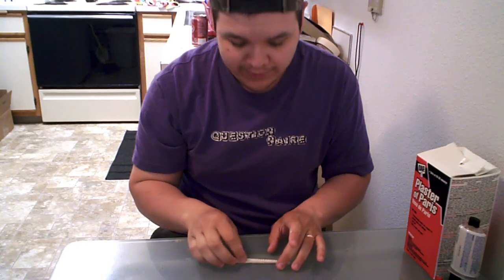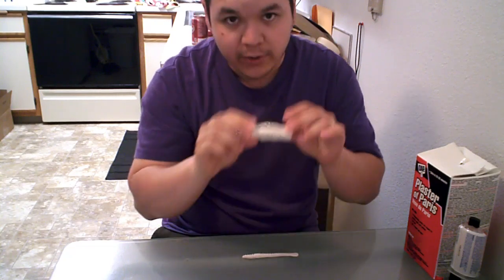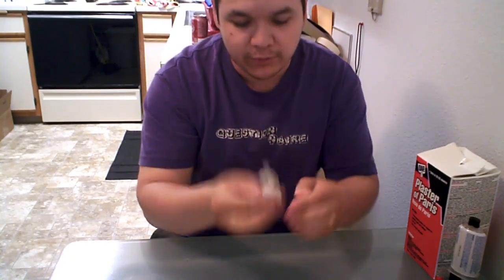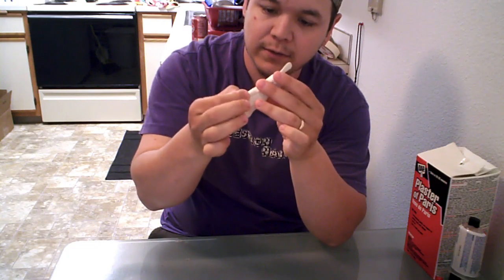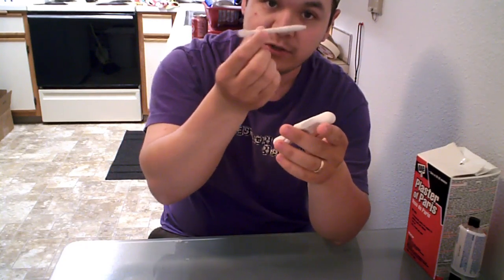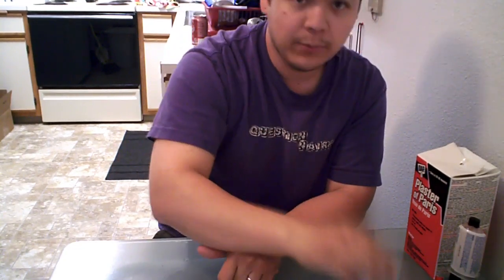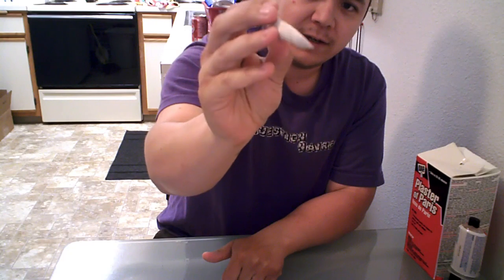Once you get that done, put it on wax paper. Get more clay, roll it out to the length of your mold, and press it over the cured prototype. Let it sit five minutes so the soft clay hardens up a bit. Then open it just barely, peel it back, and take out the creation you made. You can see the designs pressed in there. Here's a completed four-inch FT worm — the very first one I designed.